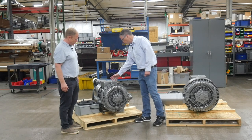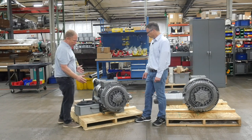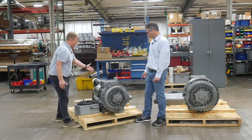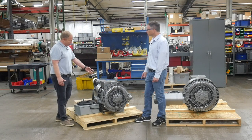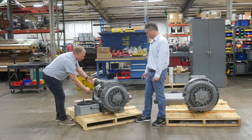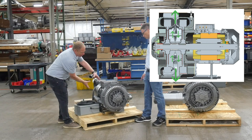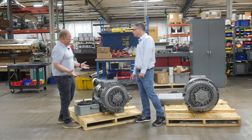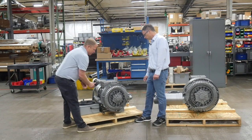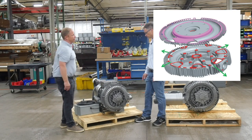Now we've moved the hotter stage closer to the motor. Is there a downside of this? No. We've done a lot of testing and we've had all good results. We've got a cooler bearing here, and our other bearing is the one all the way over on the other side of the motor. We've got a motor fan pushing air past these aluminum extrusions on the motor that are pulling heat out of there. And on the second stage, which is the hot stage, you've got a tremendous amount of air going right up against it carrying the heat away. The other thing we did is we've got a gap between these two stages, so instead of the heat transferring from the hot stage into the cool stage, this gap allows the air to vent to atmosphere.